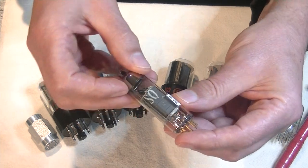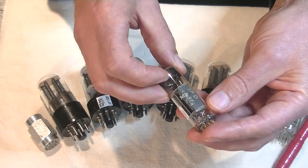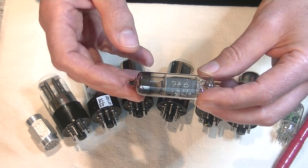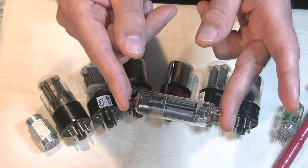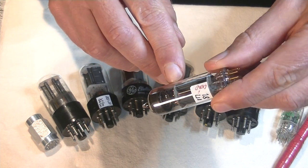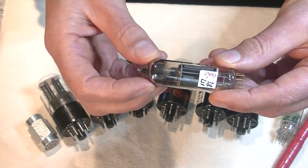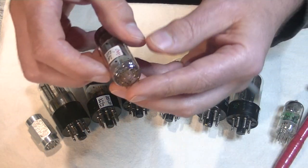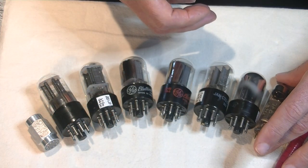Let's look at some smaller tubes. This is a Philips MiniWatt SQ — special quality. These are beautiful tubes; we're going to look at these in a future tube lab. It's an E80cc, and it is a somewhat sub for the 12AU7. It's in a big, tall glass envelope, and it's got what I would call an elevated halo getter — see the size of that up there? It's on a long stock with a large chrome dome, so very distinctive. And it's a Philips tube, so on the shoulder it's got its manufacturing code.